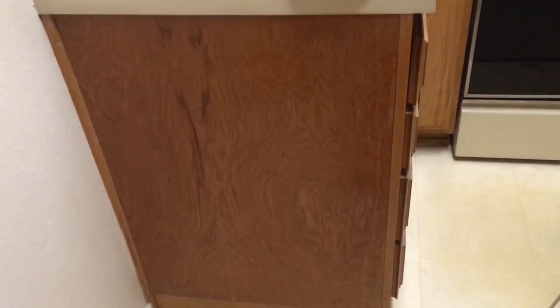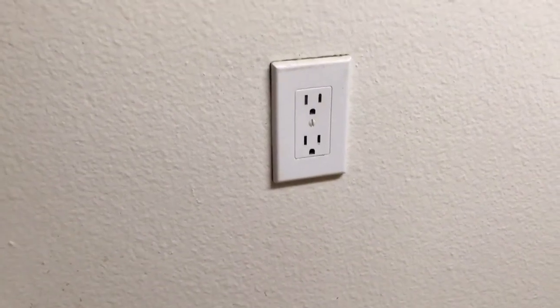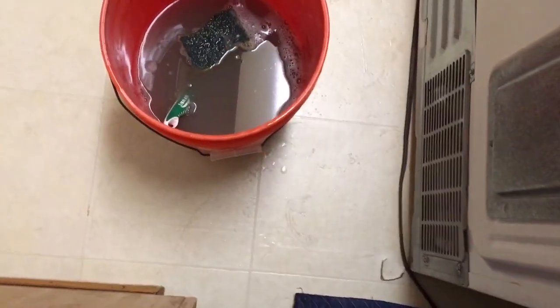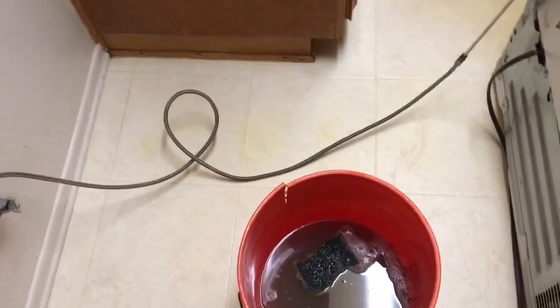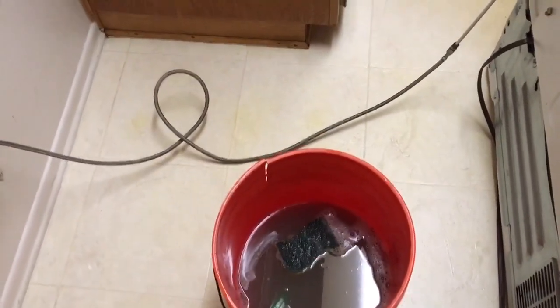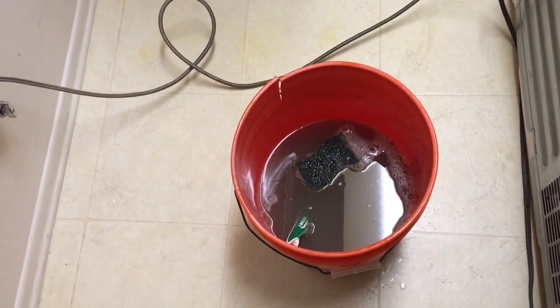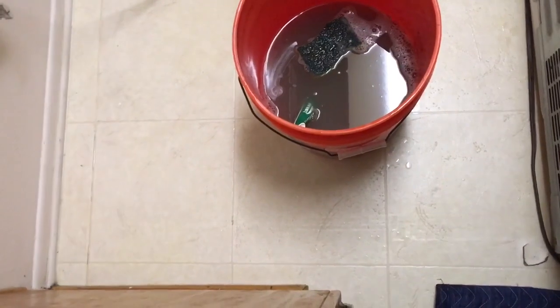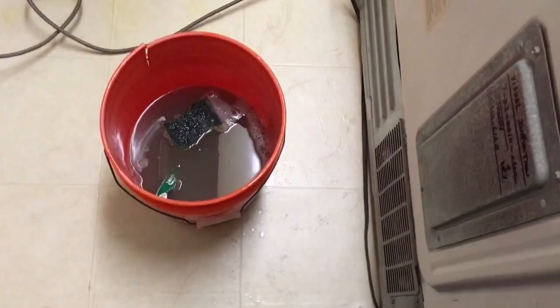Sponge off the wall and your side walls too, and go up the back, around the plug — don't get any water in the plug, just damp sponge the wall. I didn't even need to dry the floor; the sponge takes up a lot of the water. Just a five-gallon bucket and dish soap — easy peasy. Let's take off the back grill and blow this condenser out.